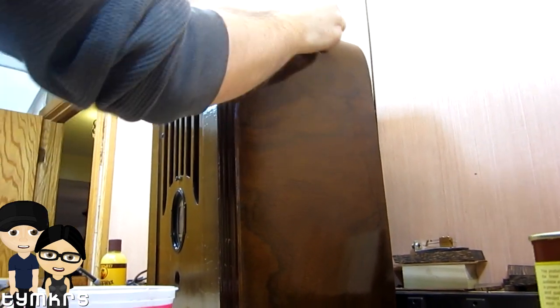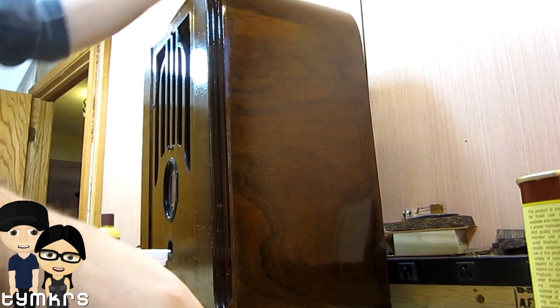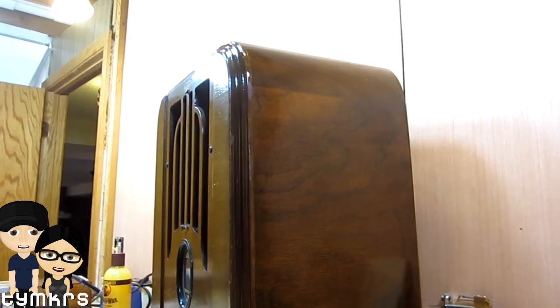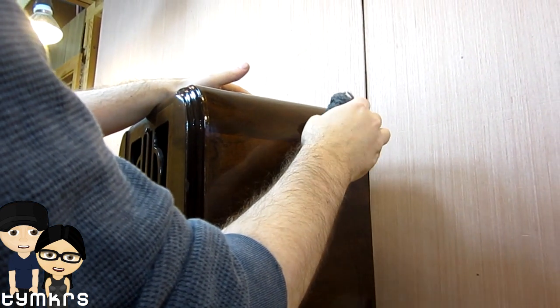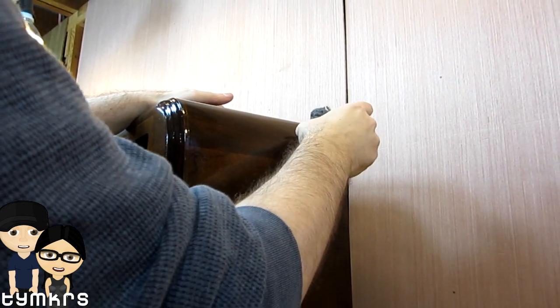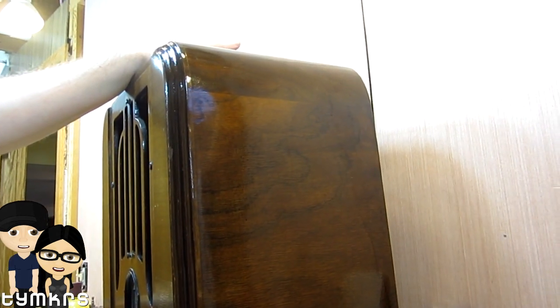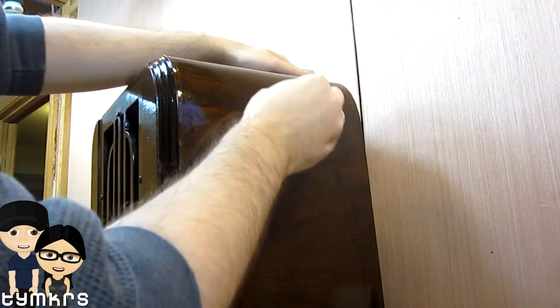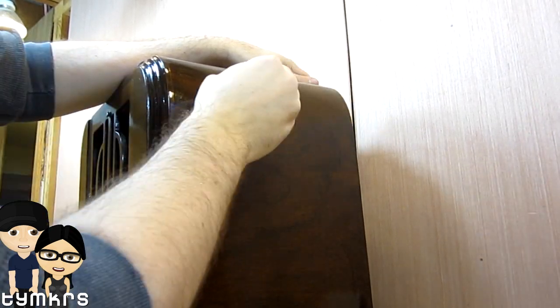This is looking really good, isn't it? Well, I think we finally got one that might be deep enough. Let's see here. A little steel wool. Just dipping the steel wool in the liquid there. Rub it out on this guy right here. We don't want to create extra micro scratches beyond. And there it is. So now I can take some more of this, and before that sets up, all nice and soft again, and that scratch is totally gone. Nice. All right, do you see any more glaring scratches left on the side?